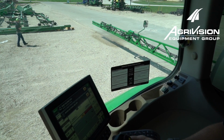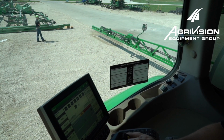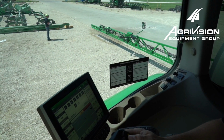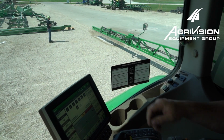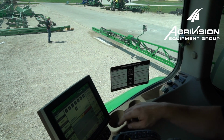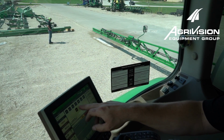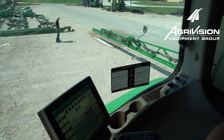Well, hopefully it's RV antifreeze, but a lot of times I like to set it down closer to the ground. You can see it from the cab, and when it starts to turn white and foamy, it's actually getting RV antifreeze out there. So then I'll shut that section off, and then I'll move to the next one.